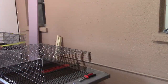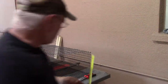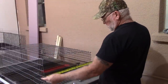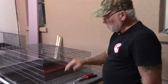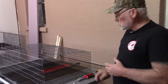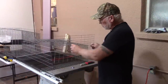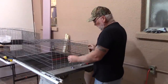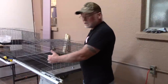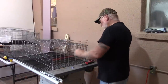The side pieces are going to measure 20 inches by 12 inches. We went ahead and cut out both side pieces and the center piece — again, those measure 20 inches by 12 inches tall. Make sure you save that leftover piece you cut off to get your 20 inches, as those can be used for the doors.